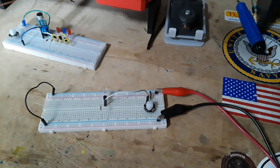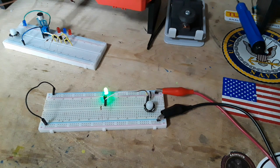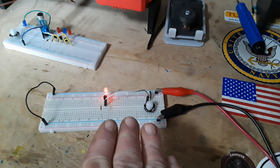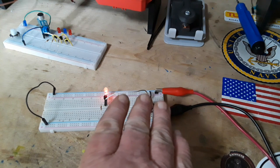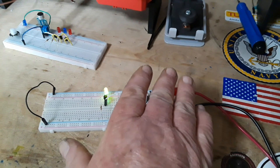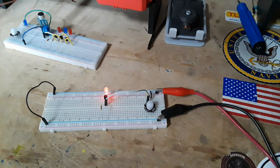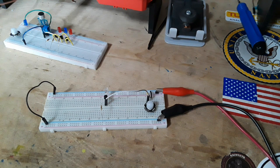On the base, which is connected to the output of the motion sensor, when it sends a voltage greater than ground it is going to open up the channel and allow this transistor to conduct, and this thing will light up and switch the different colors. I'm going to turn it on and the first thing it's going to do is turn on and go into active mode for a few seconds. Now it's off. Now if I move towards the sensor you see it comes on for just a few seconds, but if I keep moving and coming towards it, it will slowly blink and change colors. As soon as the motion stops, after a couple seconds it goes away.